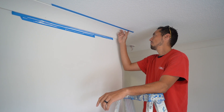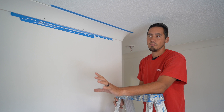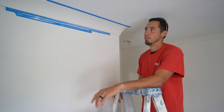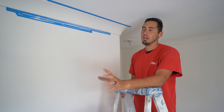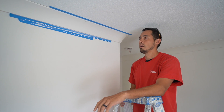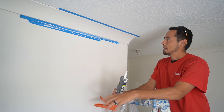Just keep that in mind — you don't want that. It's a nightmare when it pulls off the paint. We go back and touch it up, unless it's a faux finished wall — then it's a nightmare. If you know what a faux finished wall is, you know why. Or wallpaper — I've had tape rip off textured wallpaper. It was a nightmare. But with that, that's what we would do: run this tape as a guide, then paint, and when we pull the tape it would be clean.